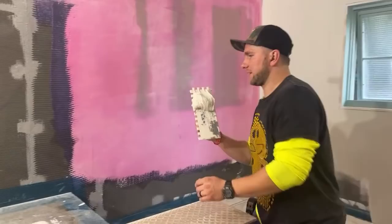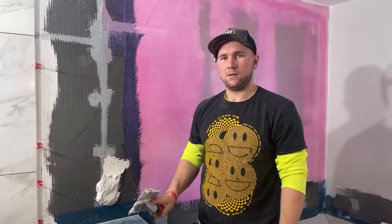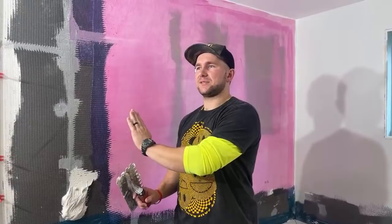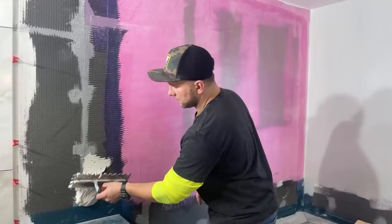Okay, from Mark, back to the wallpaper question: is it okay if I RedGard it in tile? That would help, because then any moisture from the thinset stops from separating the wallpaper from the glue. That would definitely help. Even the primer, I guess, would help.